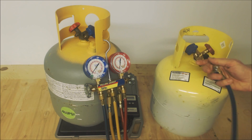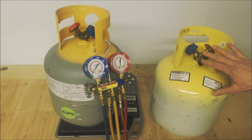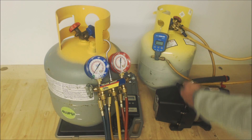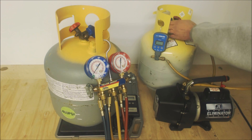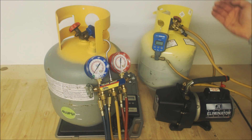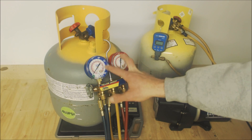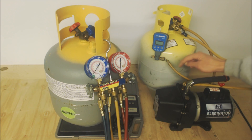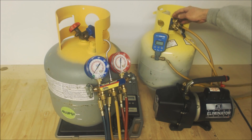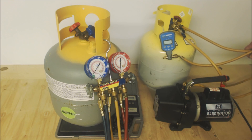What we're going to do is hook our vacuum pump to one side and put a micron gauge on the other side and suck it down. To keep it simple, we just have a line connecting from the vacuum pump to the blue side — the vapor port — and we open that handle all the way. If there is nitrogen in the tank, get rid of it and bring it back to zero psig before hooking up a micron gauge. You don't necessarily need a manifold set. From the red handle — the liquid port connected to a dip tube that goes almost to the bottom — we connect directly to our vacuum pump.